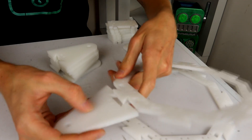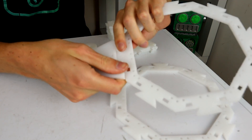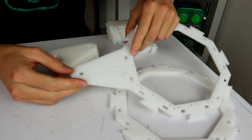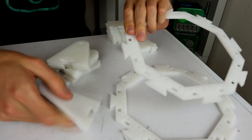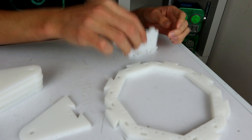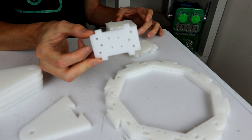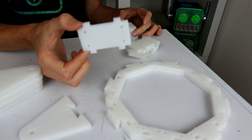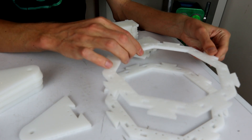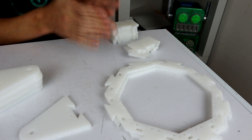Okay, mark two. These ones are quite tight to the point where I'm actually probably going to need to file them out — I just got my tool path slightly wrong in the last one. There we go, now these just lock in. The next thing I want to do is file these so that the uprights go in. We've got two different types of uprights: motor mount uprights that have more holes in them, and regular uprights that just have the two mounting holes in them. Everything kind of sits up like this and then we'll have bolts running top to bottom.